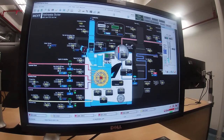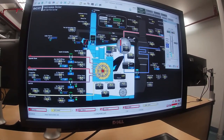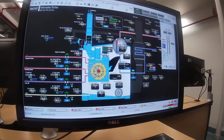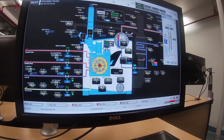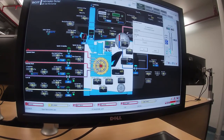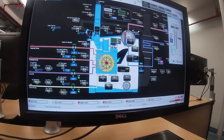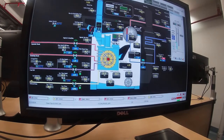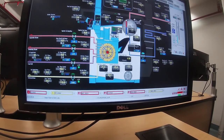This guy's at 17.4, the air's at 17.4, this is 17.4, the gas is coming up a little bit. We're still running with high excess air because the air led the fuel on the way up. I'm gonna push this guy up to 30 now. So I'm gonna give him 30%. And again, you'll see the air is leading. It's 20.5 when this guy was only at 18.9. And so we'll raise this firing rate up.